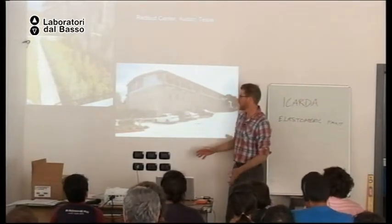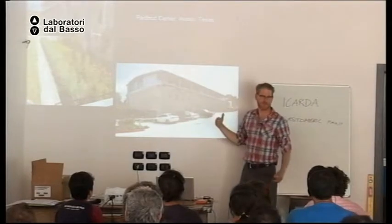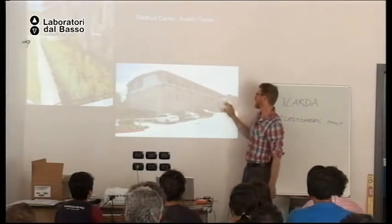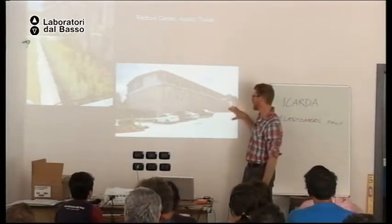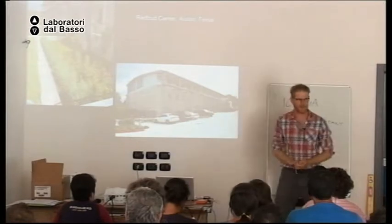This is a big building, collecting the rainwater off the building, and the gutter is sloped in this direction, not this direction. Why do I love that? We could put the cistern here, but I love the location of that cistern. Exactly. We are using the height of the roof to our advantage. So we move the water to the highest part of the landscape, and then we can use gravity to move it down to irrigate all of this with no pump.